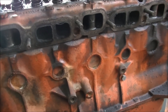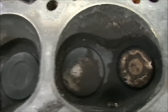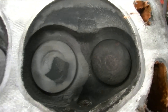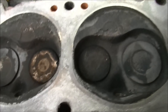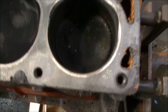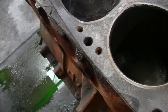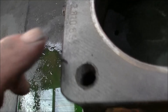So I'll pull it down, let's have a look inside. There's the head off. Nothing looks in bad shape. I don't see any seats that have been smashed down into the head or anything. Nothing looks like anything really, other than the patch. She's been sooty — it's had a lot of soot, probably because they've driven it on the choke too much, or maybe the carburettor's not right. There's nothing really concerning, no massive ridges. That's a genuine gasket, so I'd say this head's never been off.